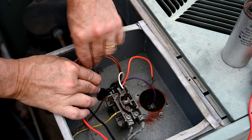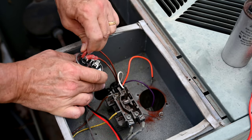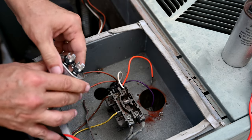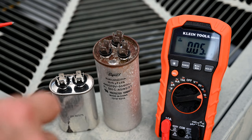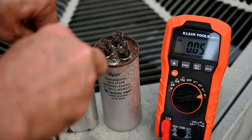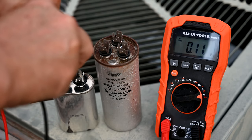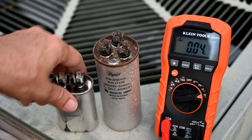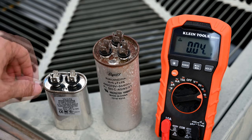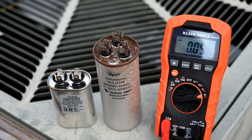So here I'm also going to disconnect the fan's capacitor and get it measured up too. I'm going to take my leads and put them across the terminals there — and we're not even measuring any microfarads at all. It's showing nanofarads, which is even worse. That says to me that this little capacitor here is spent. I'm supposed to be reading 10 microfarads, and I'm not getting pretty much anything — what I'm getting is negligible.